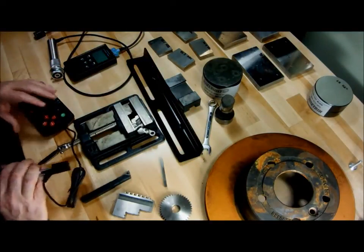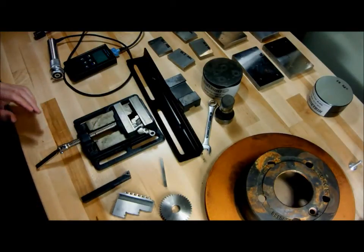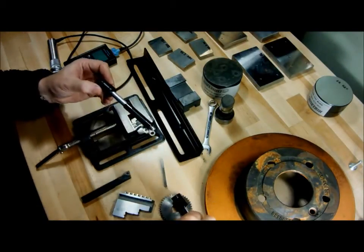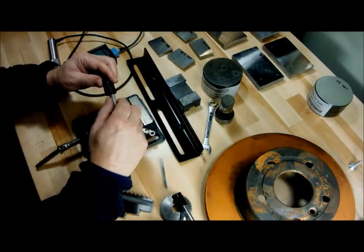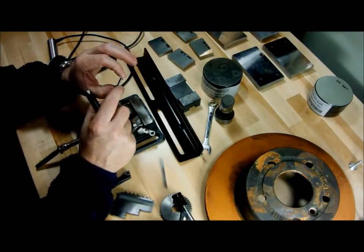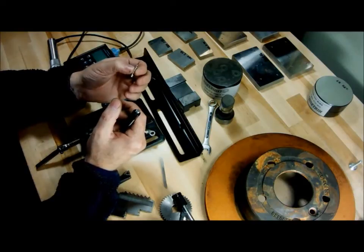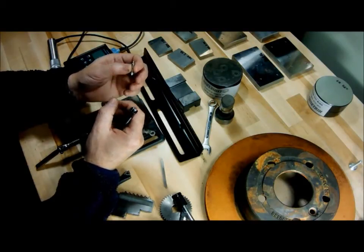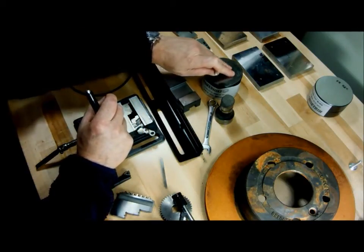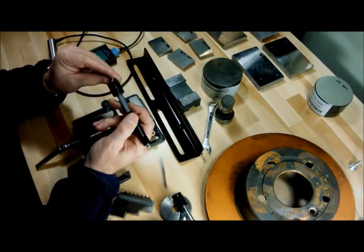So if we do have conditions where we need to measure other parts, we need to install other test probes. The C type probe is here — as you can see it is almost identical to the D type. The difference is that the little test slug fired at the part is much smaller and is not fired with as much force. It has the same little carbide ball but it can measure down to half an inch uncoupled. It can even go down to a millimetre or thereabouts if the part is well coupled — meaning it mates very well with a heavier part, perhaps with coupling grease. So what the tester thinks is it's one material. This is the C type probe.